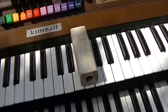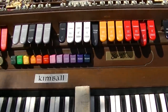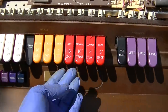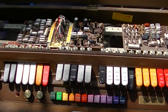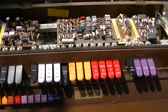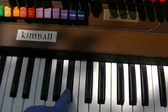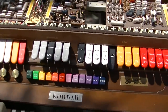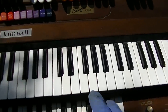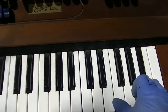And this is just kind of that general crash noise. So I wonder what's going on here. Several things. It's probably a bad capacitor or another bad connection somewhere on this specific key right here. A whole bunch of these are not working. Okay, this is an oscillator divider problem, because you can hear there's no pitch change.